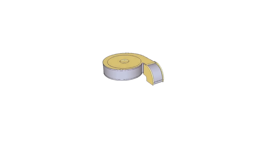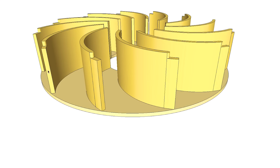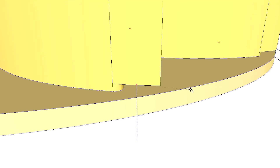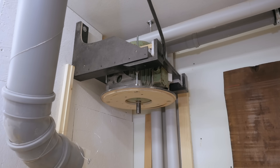Moving on to the new design. I worked several suggestions from people into it. The impeller size will be 45 centimeters in diameter and 85 millimeters between the discs, and the vanes will be glued into stop grooves so once they're glued together they are really locked in there. First, a quick check if the motor still runs smoothly.